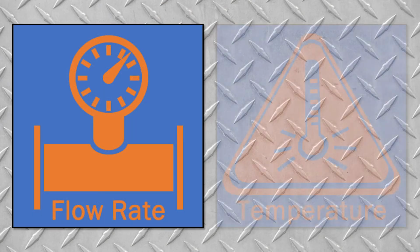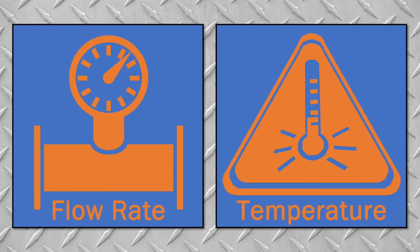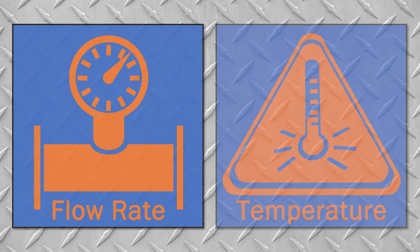One of the terms that is often used when talking about waste heat is the quality of the waste heat. Remember, if I have a river of warm air with massive amounts of air leaving, the amount of energy being carried out with that warm air might be huge. But because the temperature isn't that high, it becomes more difficult to use. So the two parameters that determine the amount of energy you're losing are the flow rate and the temperature. Higher temperatures are going to be easier to use, but lower temperatures are more common. Therefore, the quality of waste heat has to do with how high its temperature is, which will dictate how you can use it. While being a little bit arbitrary, there are some classifications that describe the quality of waste heat.